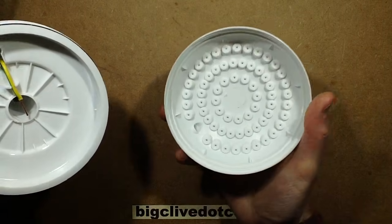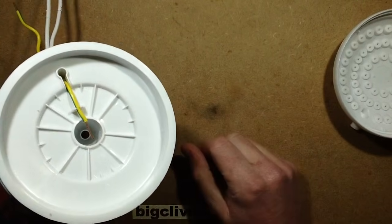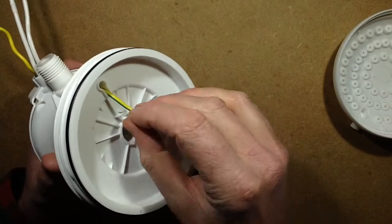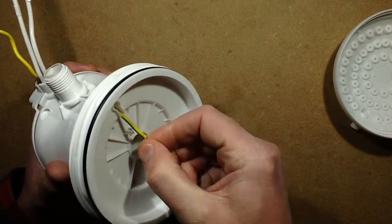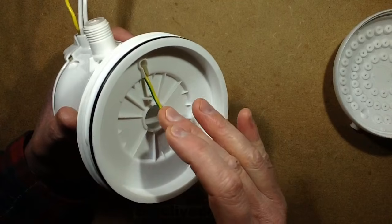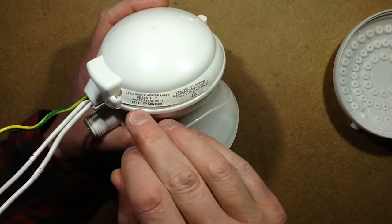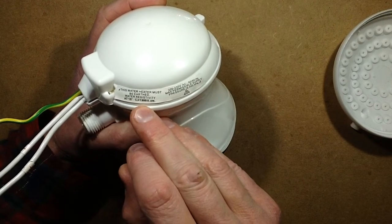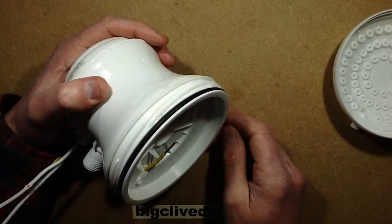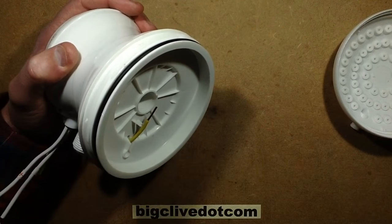I'll unscrew the end of this. Here's the outlet, and a clue as to what's coming is the earth wire that just sits with the bare end across the output. It's very clear that while they've been sealing this in, they've pushed this through silicone, and when I first took it out, it was completely covered and insulated with silicone — which would defeat the purpose. The purpose of the earth wire is that any residual current flow through the water is grounded through it. The manual specifically says: "this water heater must be earthed. Water resistivity at 15 degrees centigrade: greater than 1,300 ohms per centimetre." Testing with a standard low-current, low-voltage test meter showed resistance of about 120 kilo-ohms.